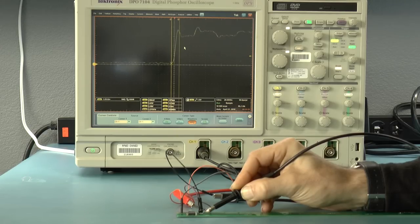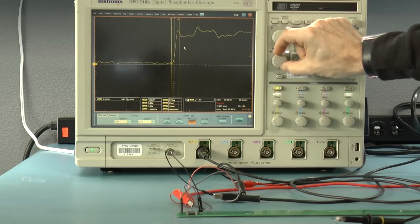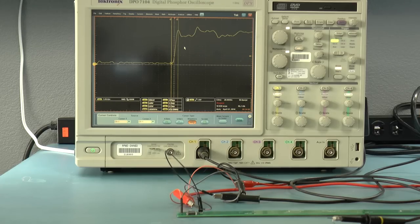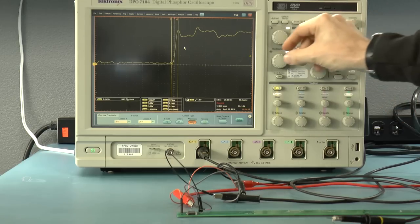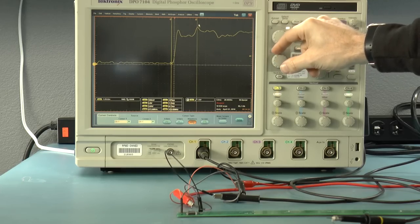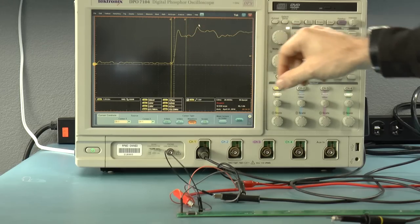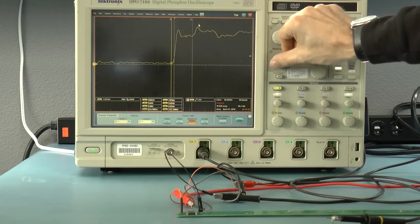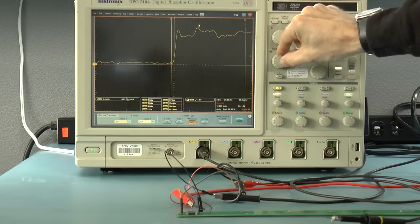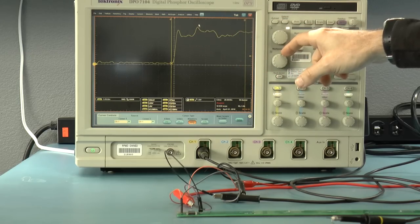Here I'm probing the very beginning of the transmission line and you can see that there are a lot of reflections going on. If I measure the top value, it looks like it's going up to about 3.7 volts — so that's not quite the doubling I would have expected. There's another reflection further down that looks like it's even higher, at 4 volts. The settling voltage looks like about 3 volts. So it bounces up to something like 3.6 volts, down to 3 volts, up to 4 volts, back down to 3.6 — then it comes down to about 2.9 and eventually settles around 3.3 volts. There's nowhere near the clean signal you would see with a properly terminated transmission line.